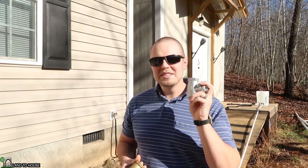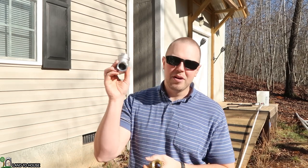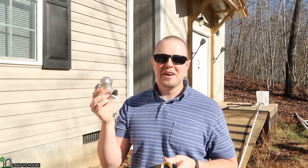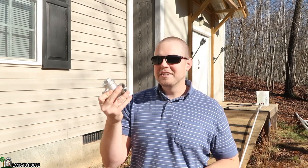There is one downside to improving the valve quality: the flapper is heavier than in the brass valve. So it's going to require more water to close this valve, and today I want to find out what that new volume is going to be.